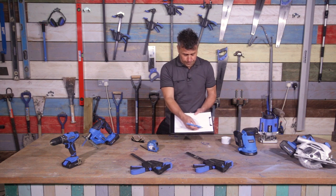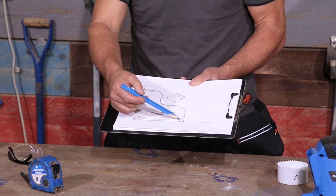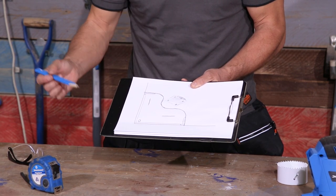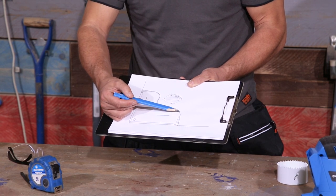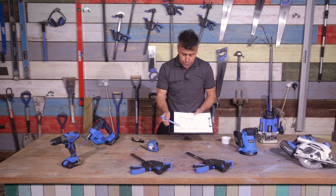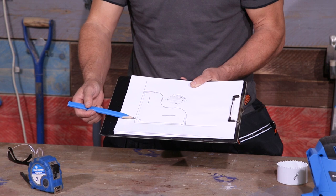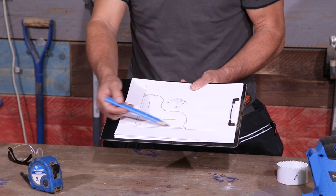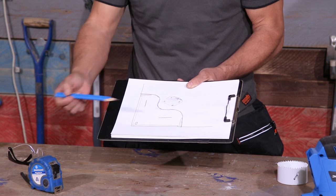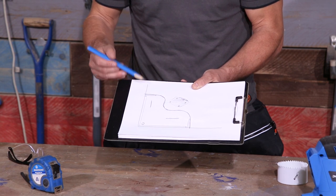This is the corner of my room. I'm hoping it's more or less 90 degrees. If it's not, I'll show you how to trim the board down to create that exact shape so you've got a nice snug fit. I want a nice curved edge to my bespoke desk, curving around with nice soft edges. I'm going to drill a hole in the corner using a hole cutter to allow plugs to come through to the back of my computer. I'm going to fit a baton to the wall on the underside of the desk — it won't be seen — and that will take the majority of the weight and keep the desk level. Then two side brackets here and here, which will fit more or less down to the floor.